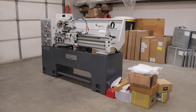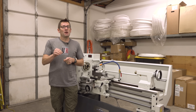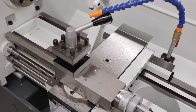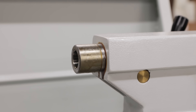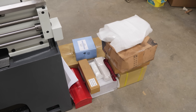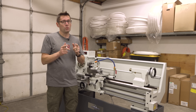This is exactly how the machine came, just what it looks like out of the crate and set onto the shop floor. Next, what I'm going to do — I like to use a spray bottle and WD-40. We're going to spray down all of the surfaces that have the protective coating on it. It's a thick, oily kind of compound. We're going to get all of the accessories — the four-jaw chuck, the three-jaw chuck, the DRO — out of the boxes. I'll give you the summary and we'll show you the final result when we're done.